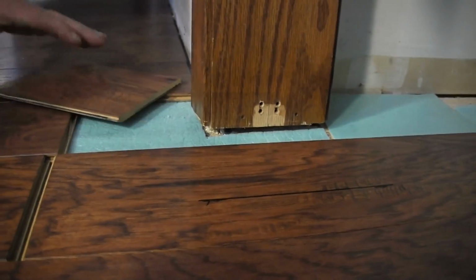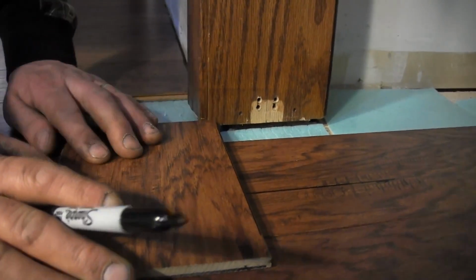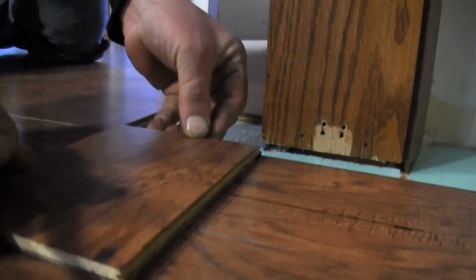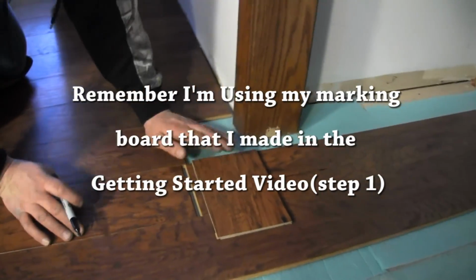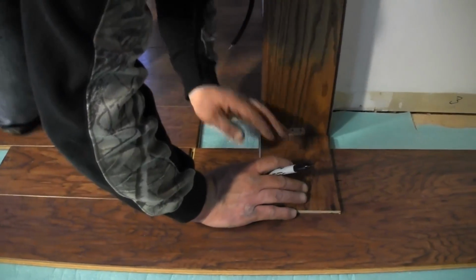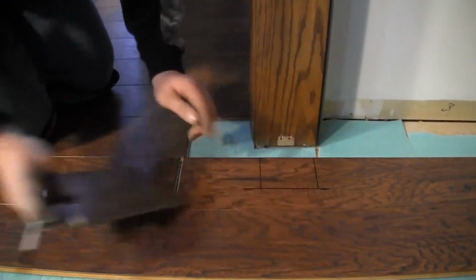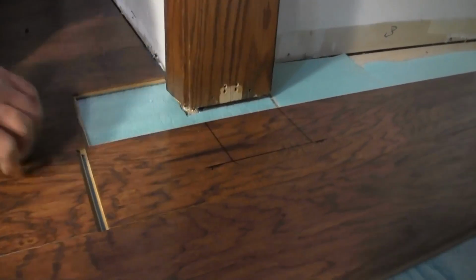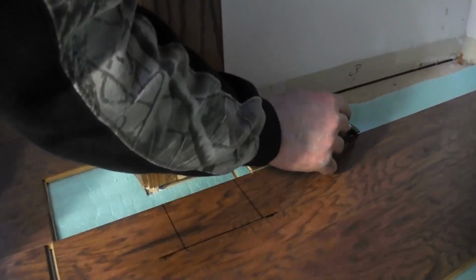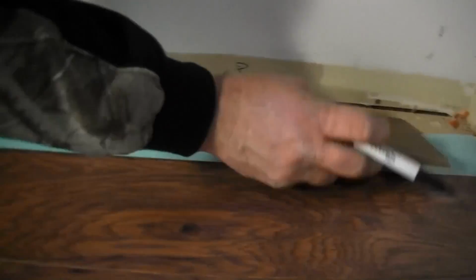and that's where it's going to go underneath. Now as far as this goes, I just do the same thing here. I come in a little bit and I'll make a mark. Now I can just go straight off the floor. I lined this edge up straight with this board so I know that it's sitting on there straight because it's two factory edges. Draw my line, and I can just do the same and eyeball it. Now you see right here is my cutout that's going to slide in there. Now I just go along the wall over here and do what we showed you on that very starter wall, and just mark.